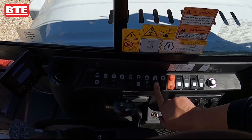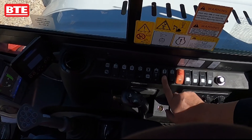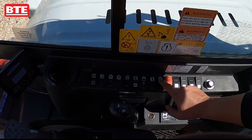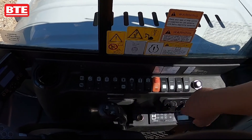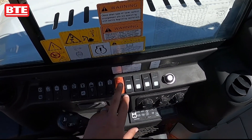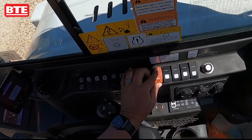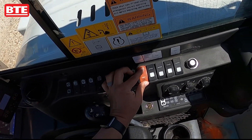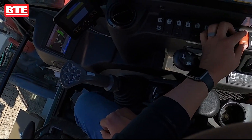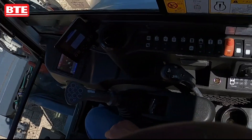This is your heavy lift function — if you want a little extra boom power for lifting objects with the excavator. This is the switch for your beacon. Then there are a couple of switches we added: number one is the quick coupler. When you want to change out attachments, pull down on the red tab and push it forward to unlock, then flip it back to lock the coupler on the rototilt.